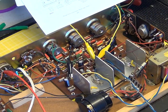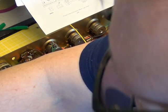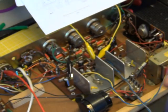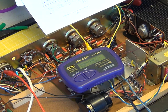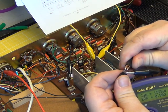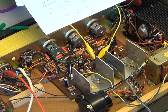After we've changed all the electrolytics, we don't switch these on until we've changed all the electrolytics, because you can end up blowing all the transistors. We've got a whole pile of those horrible black capacitors. If we put the ESR meter on — especially if we manage not to switch it on — let's see what this one reads. It should be 400 and it's reading 1500, which is always indicative that it's dried up. Let's put another small one on — it should be 8 and it's reading 44. So another one that's dried up, no good at all.